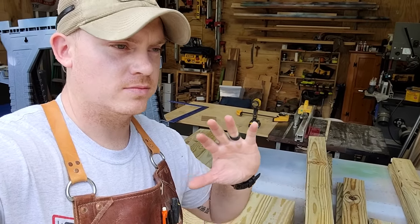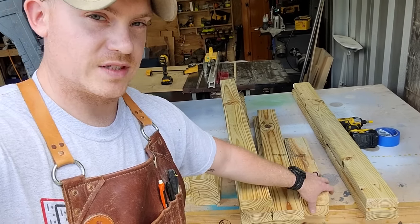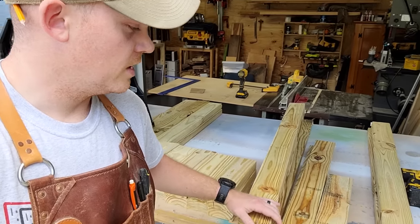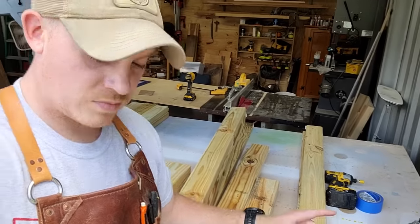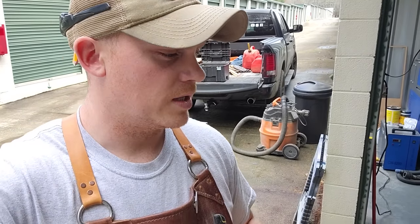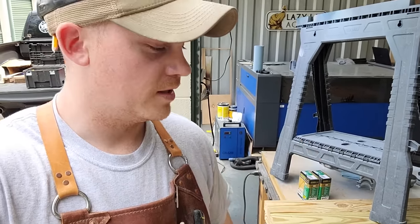After the second batch of cuts, the second six eight-footers: four of them, your first cut is going to be 51 inches. On two of them, your second cut is going to be 34 inches, and on the third one you're going to have two 17-inch cuts. That just leaves you with a little extra. On that fourth board at 51 inches, you have about a 45-inch section you're not using. The last two boards — the ones with the most waste — you're cutting at 48 and three-quarters inches. These are going to be the horizontal supports on the bottom. After this video is done, I'll make a simple Word document or PDF of the cut list and upload it to my website — the link will be in the description, free of charge.